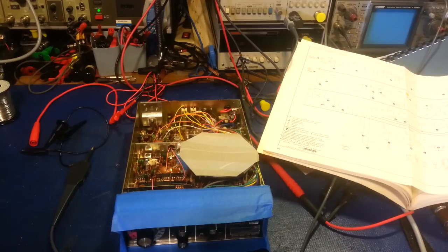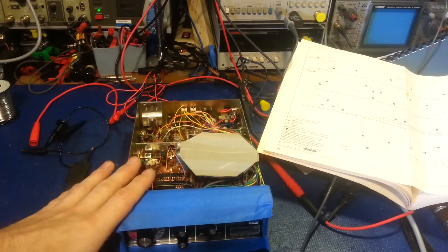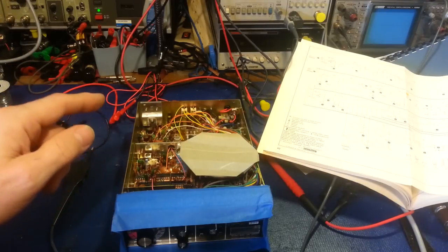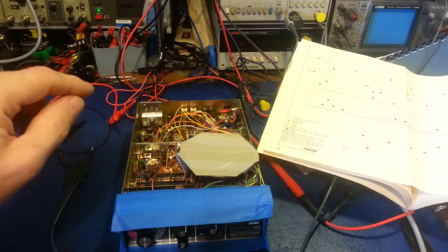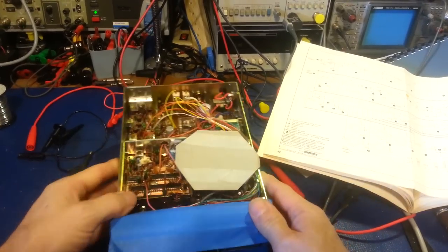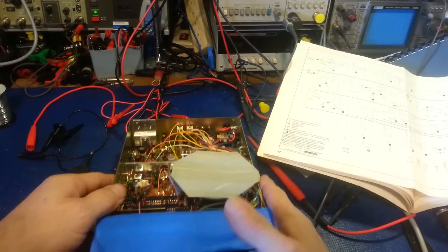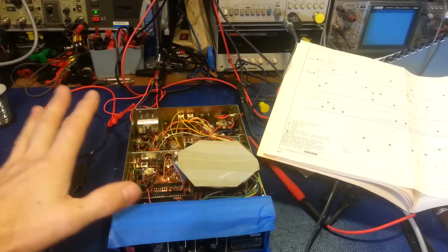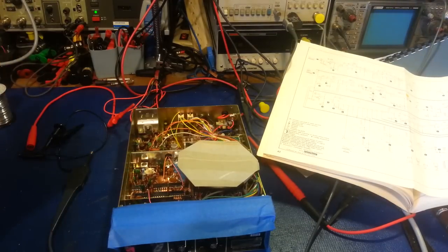My first thought was possibly an electrolytic capacitor, because it is an old radio. I've seen new old stock radios where a bad electrolytic not only failed but leaked — the electrolyte leaked out and ate traces off the board. In a radio like this, especially the PLL area, the board is double-sided and those traces are copper. Luckily none of that happened here, but it is dead.